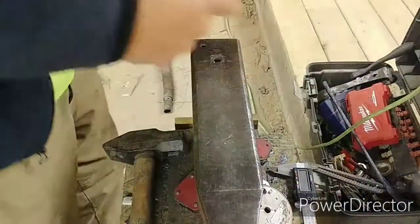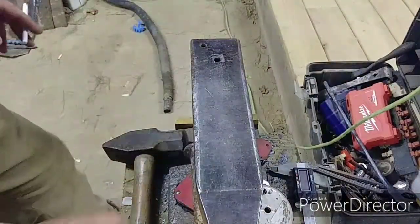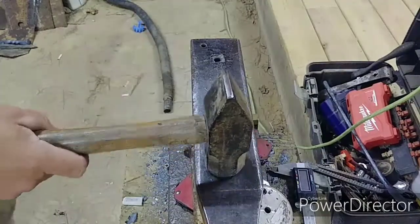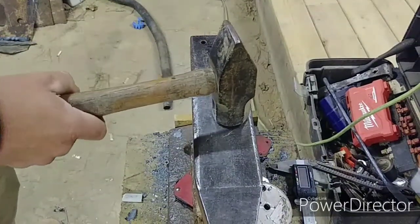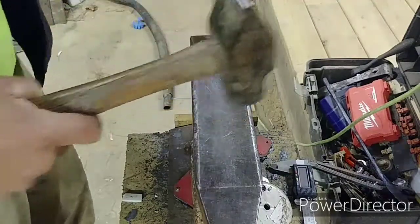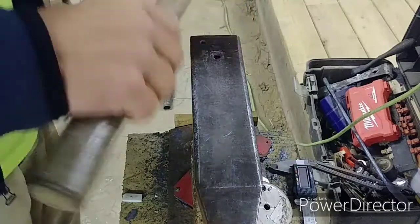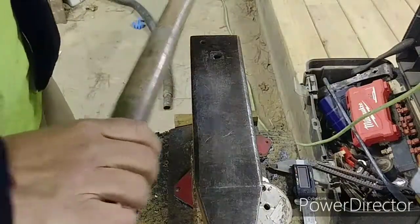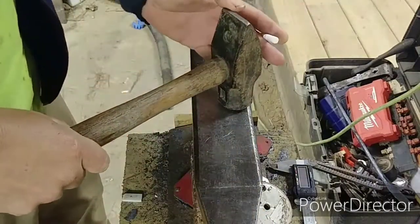Last video, I had some really great advice come in about things that I was doing. Bentum mentioned: find a place on here that has the most mass, which is usually going to be about center. Put an X there and make that your hammer blow. Move the piece, don't move the hammer. So, consistent blows in the same place, moving the piece. As far as this stupid thing wanting to twist, JT over at Grayson's Forge mentioned shaving some of it down on the sides. That should help with the twisting.